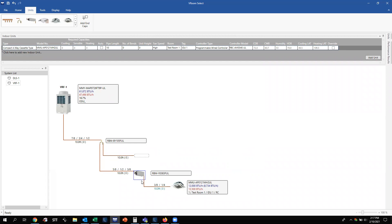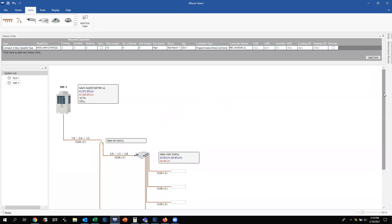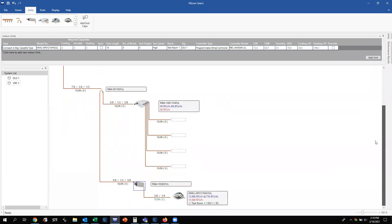For a multi-port flow selector, left-click it on the box itself, drag and drop, and choose from the two types. The number before the P in the model tells you the port count — a four means a four-port selector, the next option is a six-port selector. Let's use a four-port selector and hit OK. Now using the scroll arrow to scroll through the system, we've got a single-zone selector and a Y joint that feeds off to a selector box with four ports.